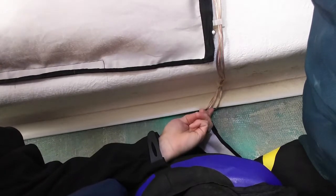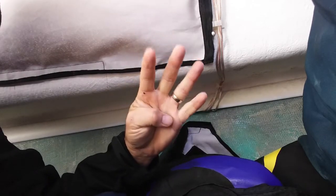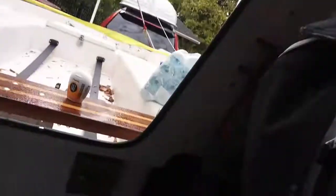Here's how I hide the wires going back to the fuse box — I've just pushed them up underneath. I have three wires: one for the cabin light, one for the anchor light on top of the mast, and one for the solar charger. That's why the plug on top has four terminals — two are for the solar charger, marked with yellow and green, which go into the corresponding plugs so I can hook up my solar panel on the roof and charge the batteries. I've got a Coleman 18-volt panel that does a good job; with two batteries, I can leave the light on for a week and they're still good.